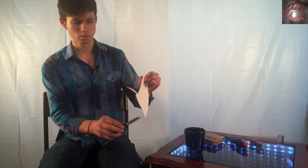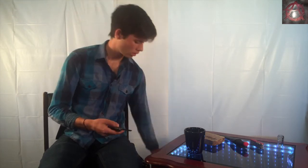Here we have a piece of paper. Let's try it out. It's pretty decent. It's not the sharpest, but it's pretty sharp. Now when you go to test your blade for sharpness, never run your finger down the blade. You come at it from the side of the blade and run your finger sideways like this. Now if your blade is very dull, you're going to need to have something more aggressive than the front of this granite at first. But this granite is perfect for just touching up your blade.